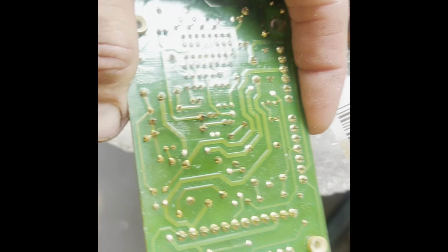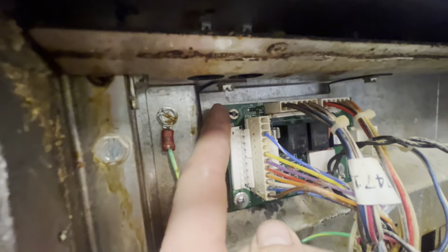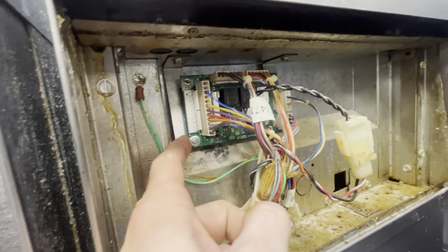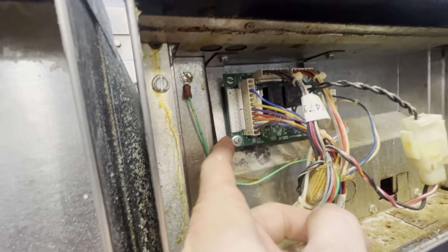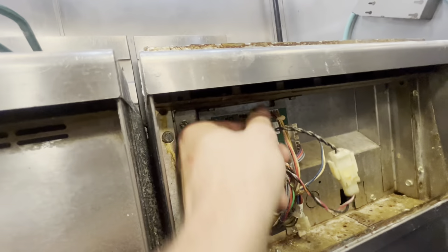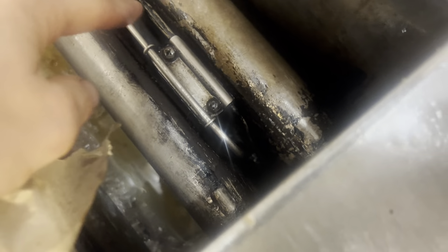There's the board we replaced - you can see some burn marks. These new posts are longer than the old posts and the old screws don't work, so I use short self-tapping screws and just screw into this. I've still got my cardboard backer behind it, but now it's tight, not going anywhere. Now we're changing the high limit.